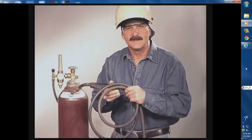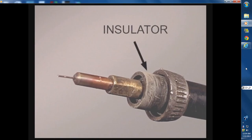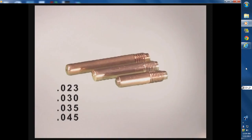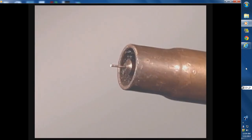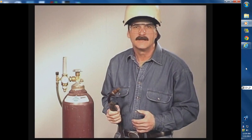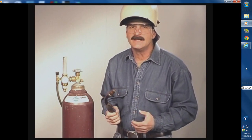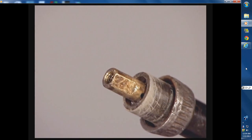Besides the steel liner, the gun assembly contains a hose for shielding gas, a welding lead supplying current to the contact tip where the welding wire is energized, and control wires attached to the trigger. At the end of the gun you have an insulator, an adapter, the contact tip, and the nozzle. Contact tips come in different sizes to match the wire diameter and in different lengths. For gas metal arc welding, the contact tip should be nearly flush with the end of the nozzle. When installing a new roll of wire, after it's inserted into the liner and the drive rolls are closed, lower the hood, turn the machine on, straighten the lead, then pull the trigger.